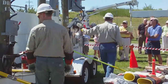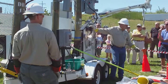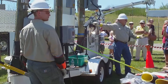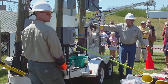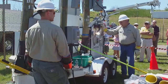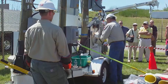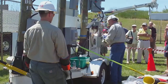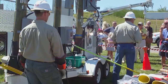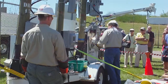We have different ways of measuring energy. We have like a 7-Eleven store, a convenience store, a gas station, maybe a large commercial building. We will have current transformers and potential transformers which feed into this metering bank, which tells us how much usage we spend. This is not in circuit. Pull that meter out, the power is still there. I know you all want that for your house, that's not the way it is.